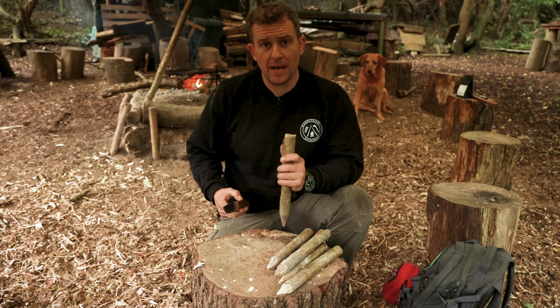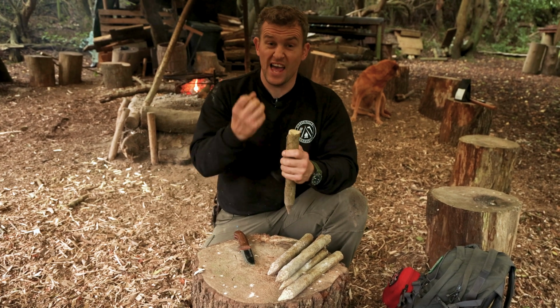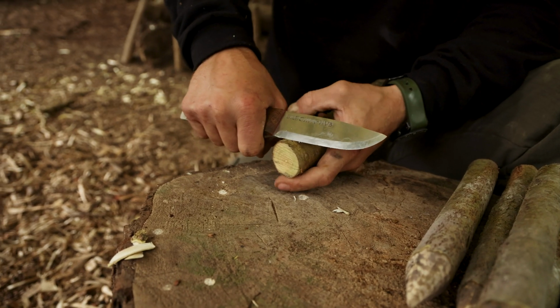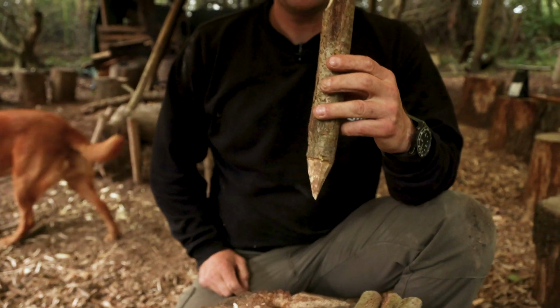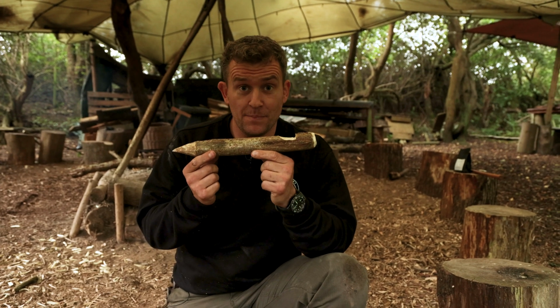So to prevent that from happening and to send all the inertia through the center of the pin into the ground, thus anchoring it, what we need to do is chamfer the outsides in. Belly goes on the outside and drive off and just push and turn the whole way round. And there you have it, in its simplicity, the basic tent peg.